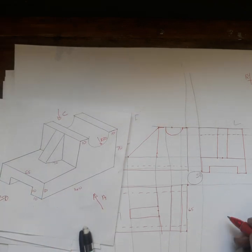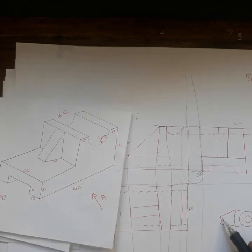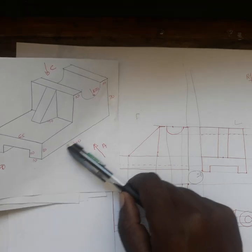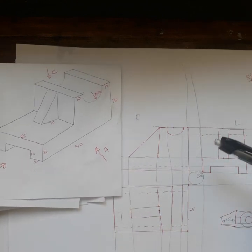After, I must write the symbol for first angle. The symbol for first angle looks like this. For the symbol you can make the diameter of the bigger circle 15 and the smaller one diameter 10. You can also make the spacing 15. The space in between doesn't matter. You take the centerline, put it horizontally, and the vertical line remains vertically. Then you must just draw the first angle symbol.